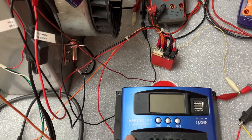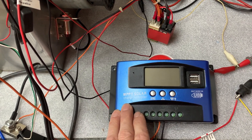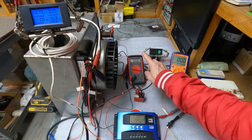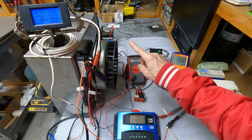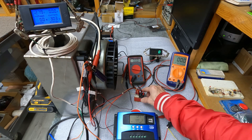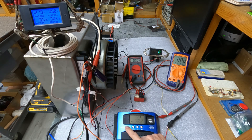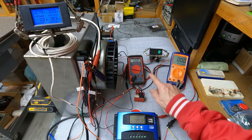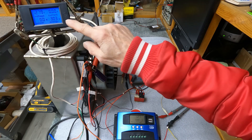Possibly about 140 volts, so we definitely fried this 50 volt unit. This is the alternator voltage, this one is the voltage on the other side of this device here, which feeds to the charge controller. That's an RPM meter, and this is the watt meter and power meter here.